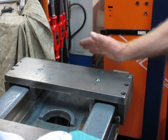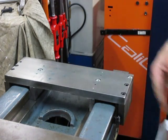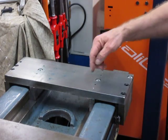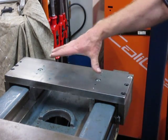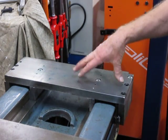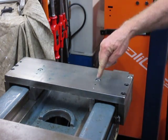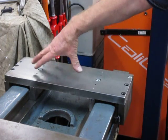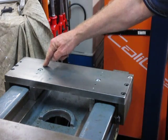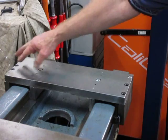In order to make sure I don't have any deviation, I clamped everything together and used the mag drill, so I had very little layout to do. I didn't have to keep marking up and measuring — I just laid it in, ran a line through it, and drilled it. I've drilled, reamed, and put dowel pins in, so those two are locked up in place. There'll be two more screws to go in on the outside.